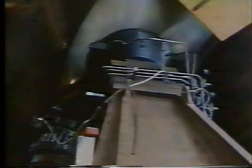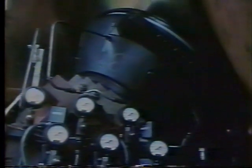Mechanical components have meanwhile been under construction on and inside the pedestal. Each of 4 main supporting hydropads and each of 4 cylindrical positioning hydropads in the tail bearing will receive about 11 gallons per minute of hydraulic fluid. The telescope thus floats and is held in position by a 5/1000 inch film of oil.